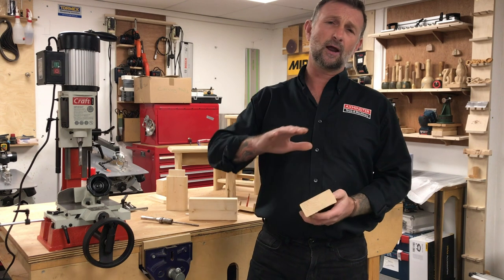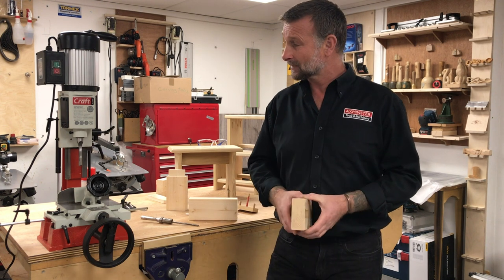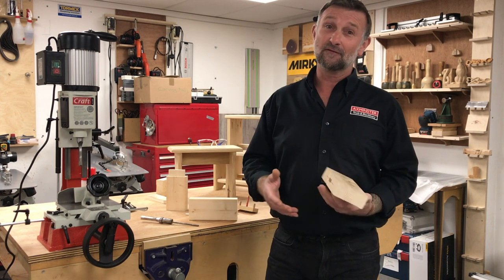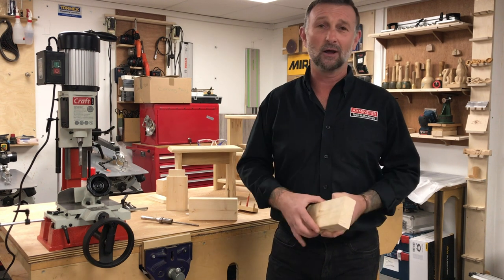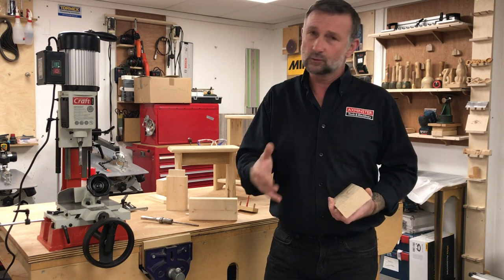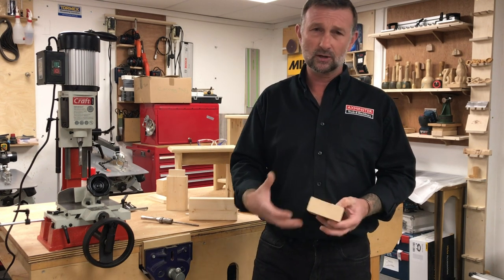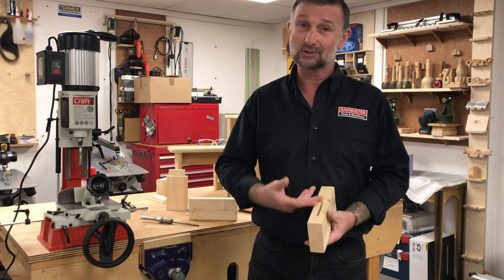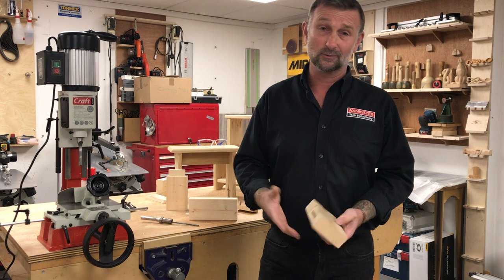These machines have been around for decades, a long time. A traditional style machine, maybe not quite as popular as they used to be. The introduction of the Festool Domino has taken some of this machine's glory, but it still has a place in a joinery shop. The Festool Domino is great — it's quick, it's strong — but if you want long deep tenons there's only so much strength you can get from it. You might need that traditional look, like a through peg tenon.